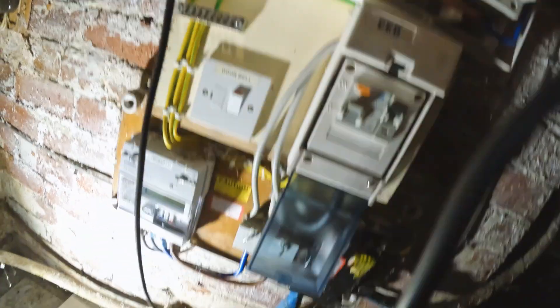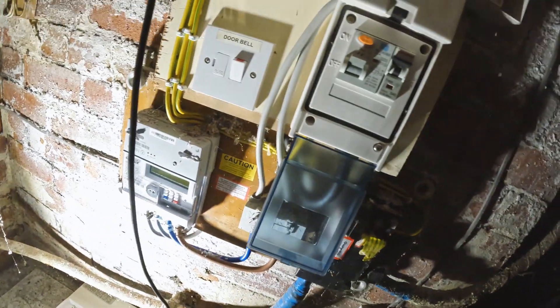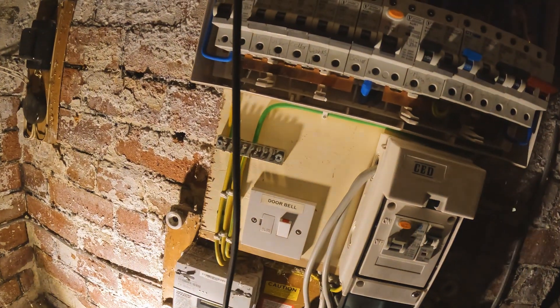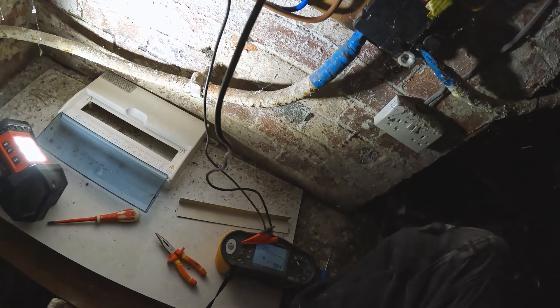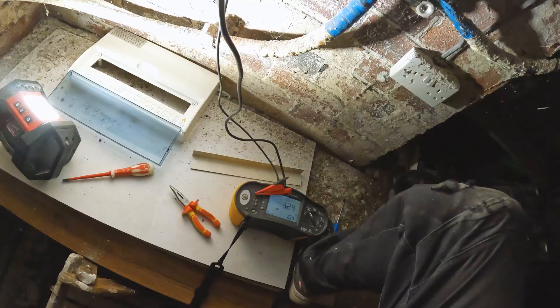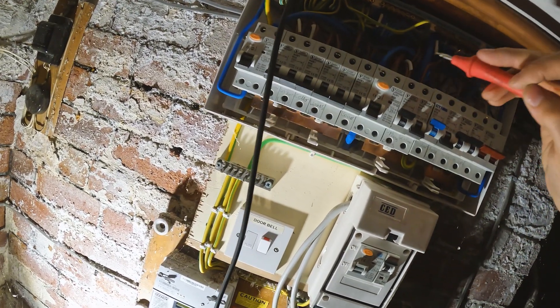Testing to the neutral bar - fine, fine. Then it's just this one labeled doorbell which could also do the lighting - we're getting 1 megaohm, still decent to be fair. Let's investigate a bit more. Testing the other side now, working along: 3 meg, 3 meg, 3 meg. Obviously if the neutrals are connected it's going to share that lowest reading. 1.55 - looks like an inductive load. 3 meg and 3 meg again - these are well over 2 meg so I'm happy these will be fine when turned on.